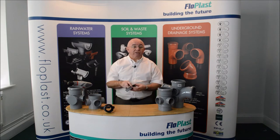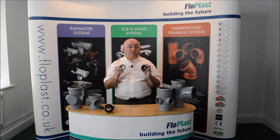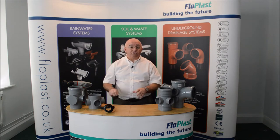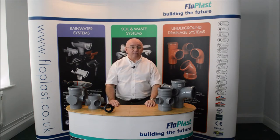The adapters are the small inserts that adapt the boss to the three common waste pipe sizes: 32, 40 and 50 millimeters. There is no standard as to the size of bosses — that is left to each manufacturer to determine. All the Floatplast bosses are 62 millimeters in diameter and are therefore larger than the largest waste pipe size of 50 millimeters, so you will need to use a boss adapter dependent on your waste pipe size.